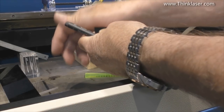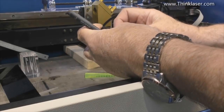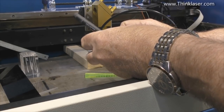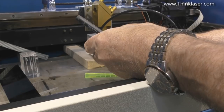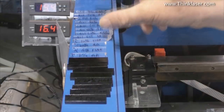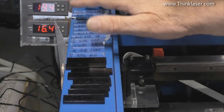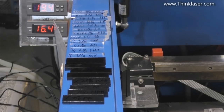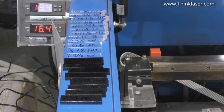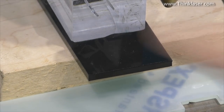That's quite a nice hot cut - I can feel it. I suppose people would class that as a mirror polish, but looking at it very critically I can still see a few striations in the background. We've now got a full set of data: cast, extruded, both clear and black, so we can look at edge comparisons with and without air assist. Now we're going from one extreme to the other - we've got a 2.5-inch meniscus lens in there.